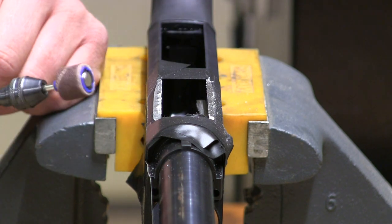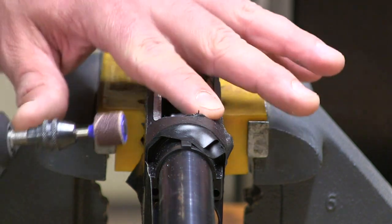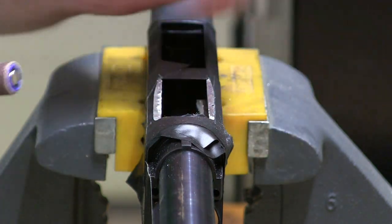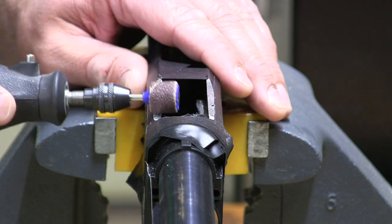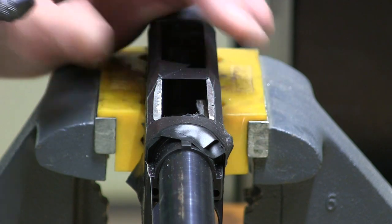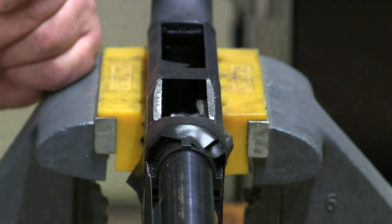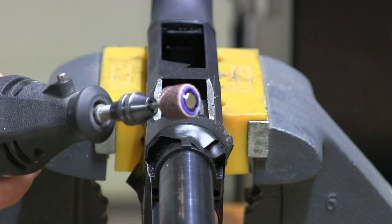Okay, I got lazy — here's the Dremel tool. I'm going to take some of this down on one side. The other side I've already taken to the maximum I can before getting into the serial number with the file, but I've got at least double that yet to go and the receiver keeps getting thicker. So I can only work on one side at a time — I'll take it down close with the Dremel, then go back to the files to smooth it up. When I'm finished I'm going to round both edges so that as I'm loading shells and my thumb is rubbing here, it's got a nice rounded surface with no sharp edges to slice my thumb, especially during practice.